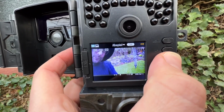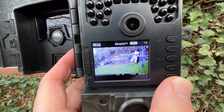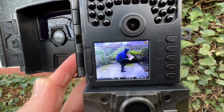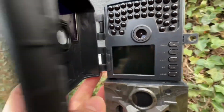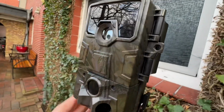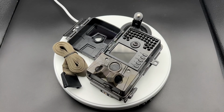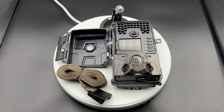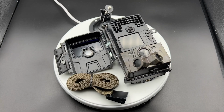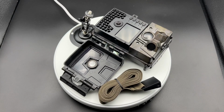Off means shut off everything. On means, okay, now we are operating and the cam will start working. Test is the adjust and setup mode, okay? In the test mode, we can choose what we need. And for the working mode, make sure that the power switch is in the on position, okay? We do not leave it in test. That's not good because nothing happens.